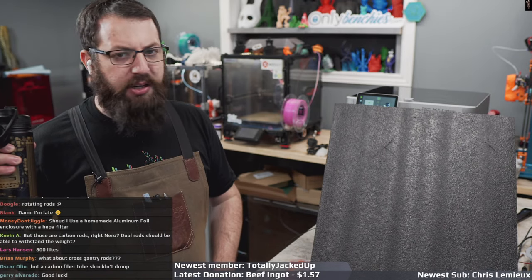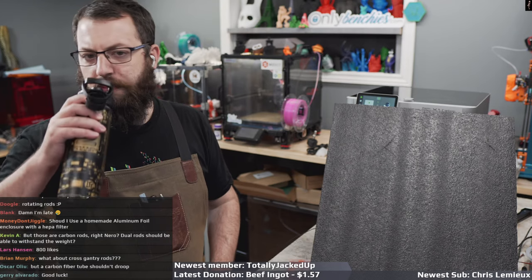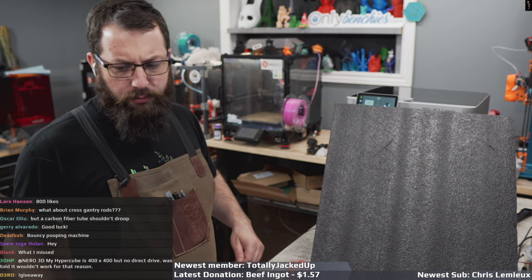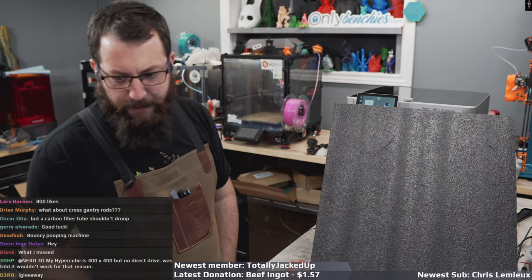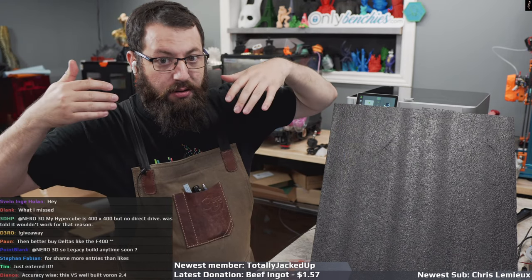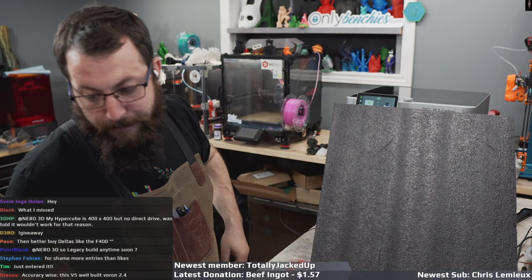Every material will droop over a distance once you load it. Believe me, there's no perfectly stiff material in the world. Also, with a longer span, when you have a nozzle that is used to activate your Z, that flex will make it so you're not going to get consistent readings as well.